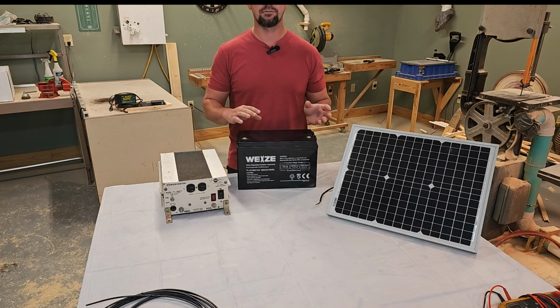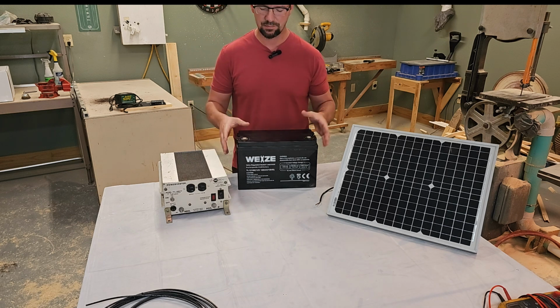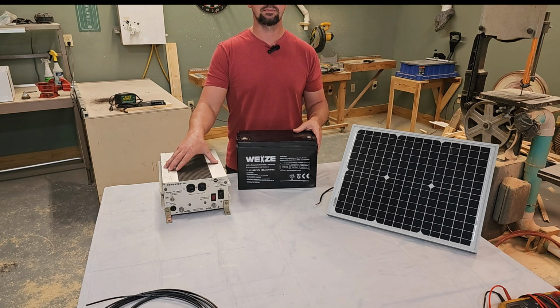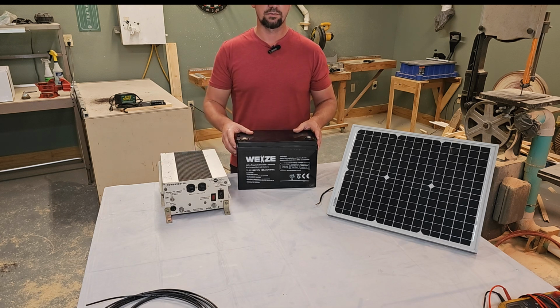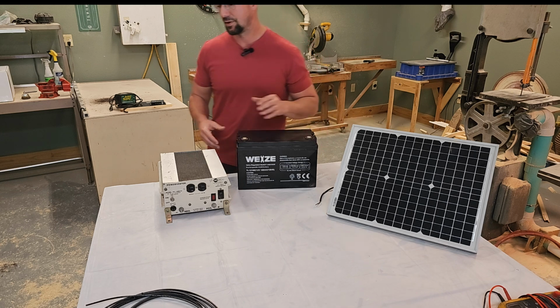So we have pressure and we have flow, and when you talk about watts, you multiply those two together. That's the math. You don't need to know this, I'm just explaining the math to you. So I want to wire this to be able to accept about 500 watts worth of electricity for this project. We're running a refrigerator and maybe charging some devices. So 500 watts divided by 12 volts is about 40 amps. I know that for 40 amps, the standard wiring practices recommend an 8-gauge wire.